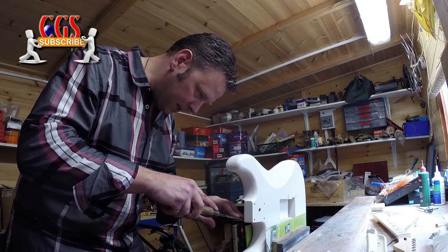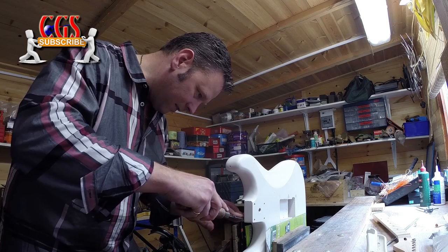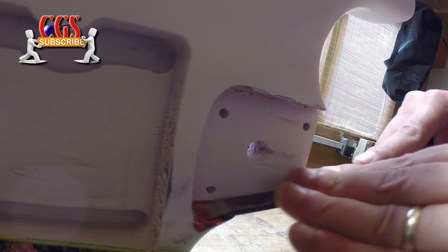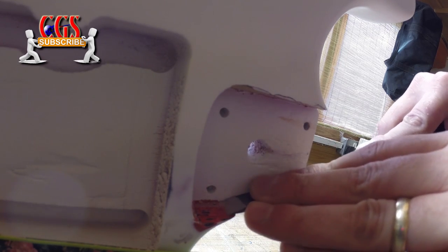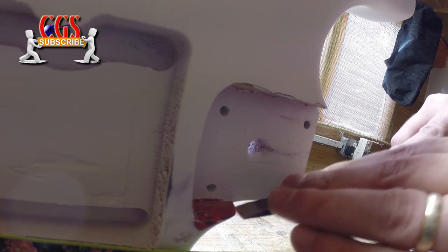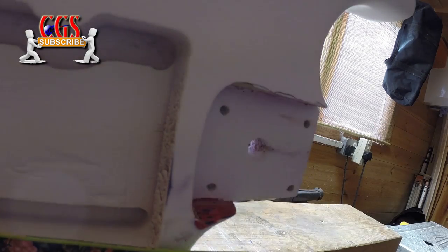Anyway, just going to let out this neck pocket a little bit. I'm just doing a little bit of work to gently chisel away at the lower inside of this pocket. I'll try to get a better angle for you. As you can see, I'm just taking it back past the red primer here and trying to make sure that we keep that bevel in place and coming out to the edge, right the way out to the edge, only taking little tiny bits off at a time, and then all the time offering the neck back up to it and checking the fit.